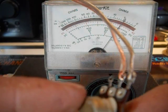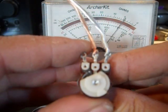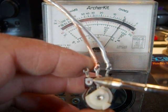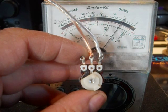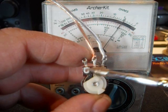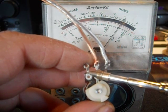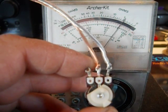We're going to show what one of these looks like inside. You have a little path in here. Your juice will come in here to the center, and it goes out to these little fingers right here — I know it's kind of hard to see. That rides on this path. This path is connected from here to here. There's a way, when you get into doing this stuff — I should have studied it before I made this video — if you can ground this, it helps pull stuff back to ground, because this is like a horseshoe-shaped path. Here's your contact riding on it.